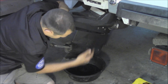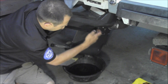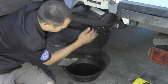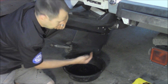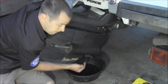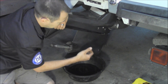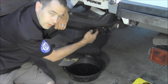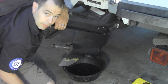In order to fill this drive once it's done draining, go ahead and put your drain plug back in and fill it from the section that says 'fill.' If yours doesn't say 'fill' and you just have two of them, you want to fill it from the bottom. Leave both of these open and pump your fluid in from the bottom hole — a lot of what happens is you're pushing the air up and out. If you were to put the drain plug back in and fill it from the top, you would never get the proper amount of fluid into the unit and you would probably burn up your unit.